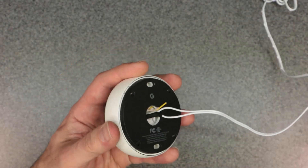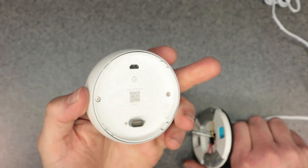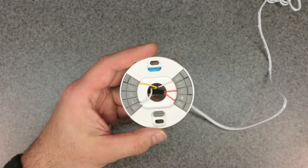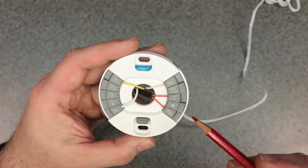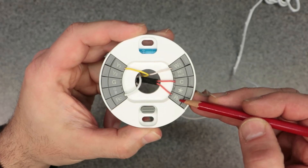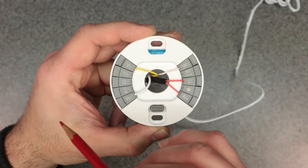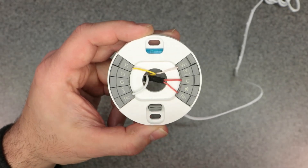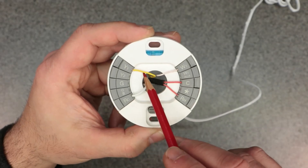Let me pop off the base plate — I'm going to turn this off just to be safe. As you can see, this is still powered up because it has a battery. If you don't know, you charge these up from the USB on the back — there's a built-in rechargeable battery. Anyways, just like the Amazon smart thermostat, we have to hook up the C terminal, the RH, and the RC. This thermostat in particular is very fussy — you have to have all the wires hooked up in order for it to continue in the menu, otherwise it gives you a roadblock and won't let you use the thermostat at all.